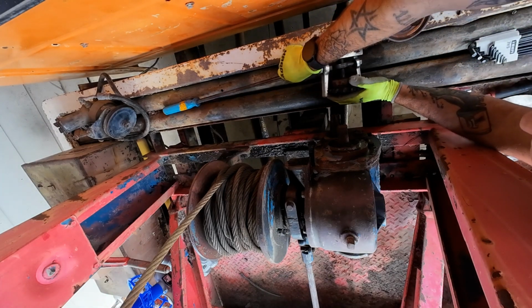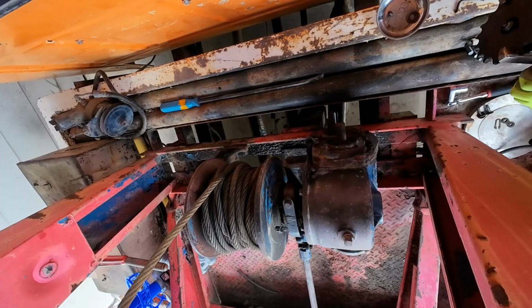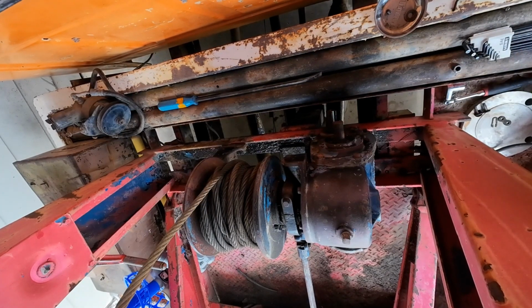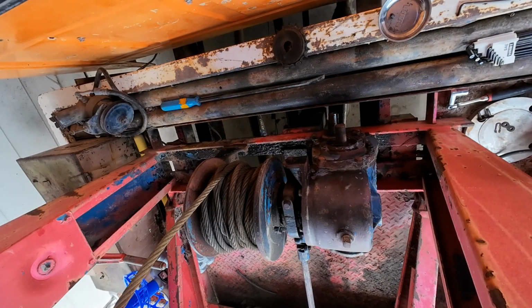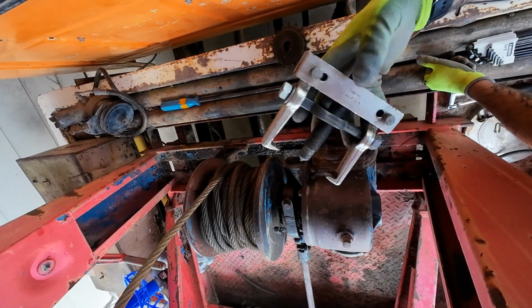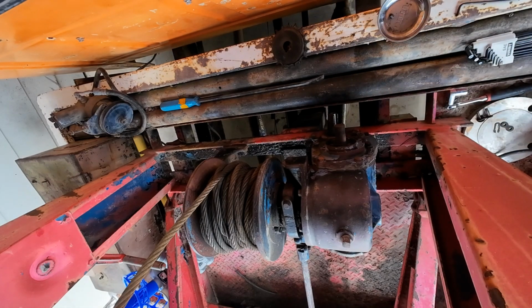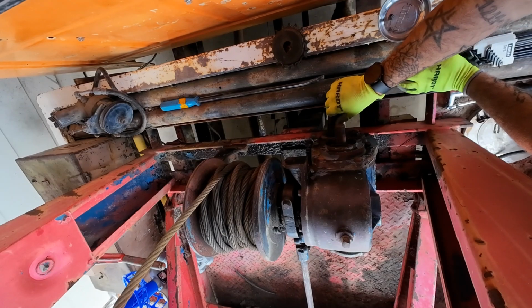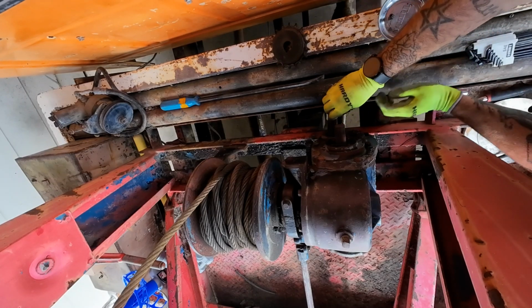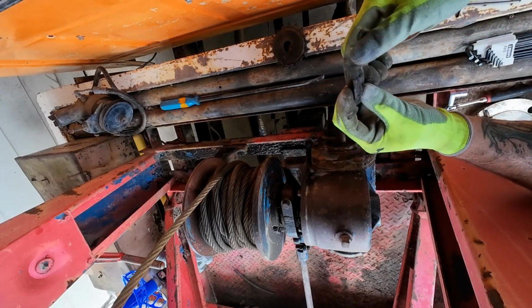Okay, that was the biggest part that I was afraid of, that pulley. And realistically, it wasn't that bad. That thing's heavy though. I've got a couple of these old Snap-on style 2-jaws, and I use the heck out of these pullers. They're so nice to have. You don't use it often, but I tell you what, when you need it, you need it. Pull your keyway out of there so you don't lose it. Also your drift, or whatever you guys call these.